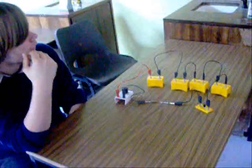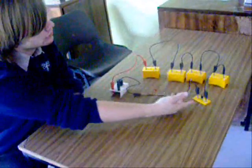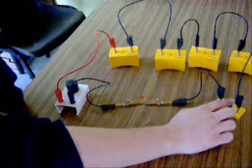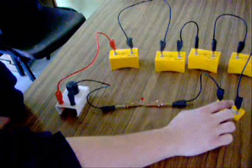The aim of this experiment is to show that a capacitor stores energy. I'll start with batteries in series, a switch, an LED, and a capacitor. When I press the switch, the LED goes on, then gradually fades away as the capacitor builds up charge.